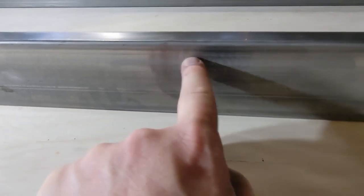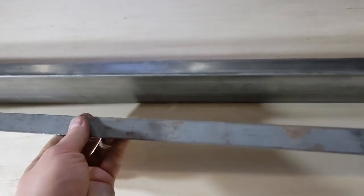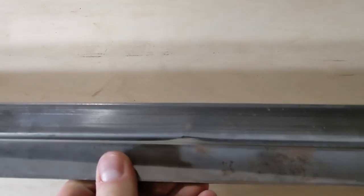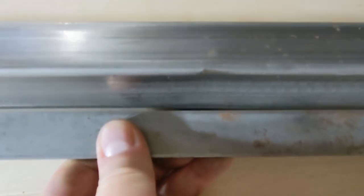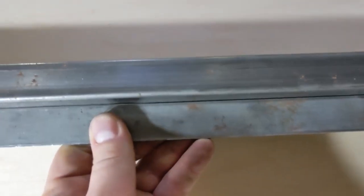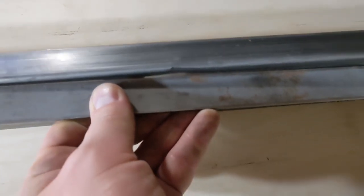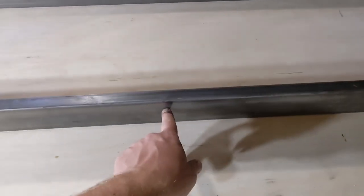It goes in and comes back out - it's not a big thing, but these are the frame rails and they're going to be visible. If I take my straight edge over to where this pinch point is, you can pretty clearly see daylight through there. Over here it looks pretty good - there's a tiny bit of daylight, this isn't a perfectly straight edge, but you get the idea. I'm going to have to select a different piece for that frame rail - it's definitely going to be a weak point.